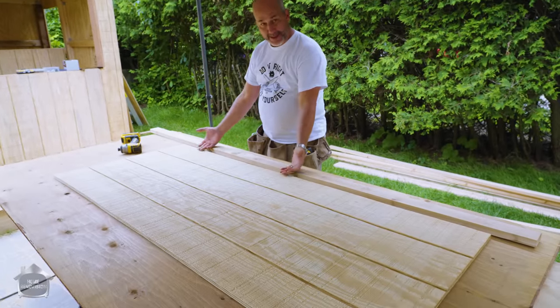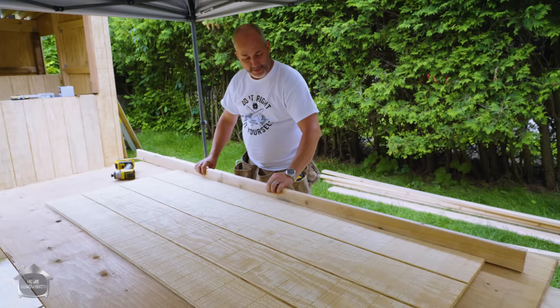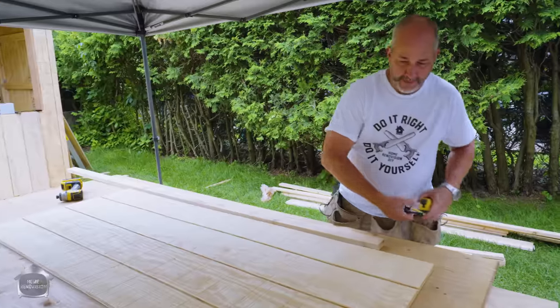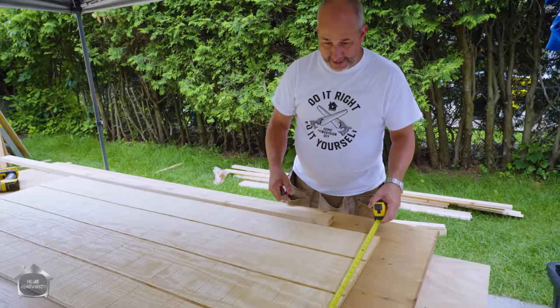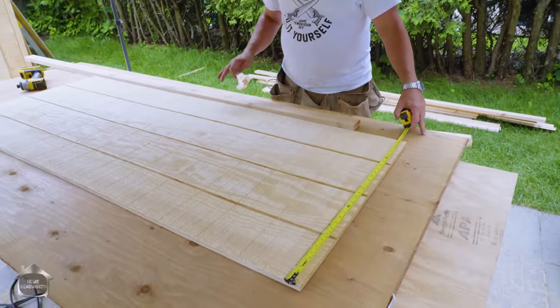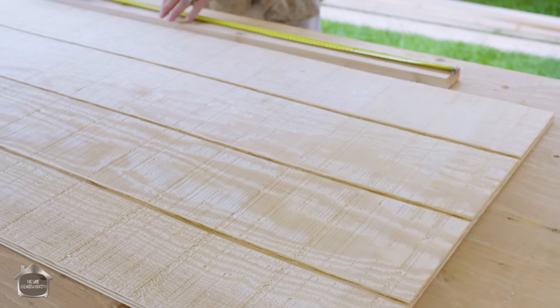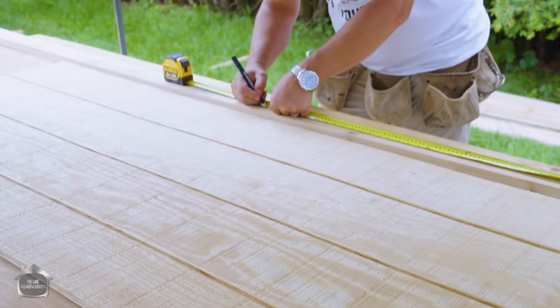And we're going to trim out the backside, and then we're going to trim out the front side like an L shape so everything stays nice and square, all right? First measurement, of course. And I'm doing this really kind of rough cut lumber. We are not going to go through any extremes. I have yet to pull out a miter saw on this entire shed build.